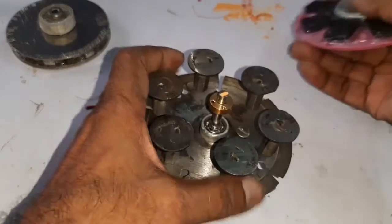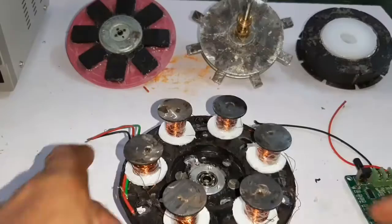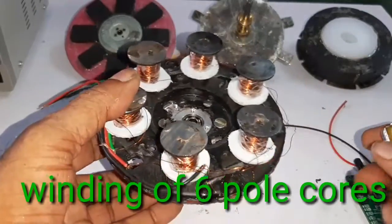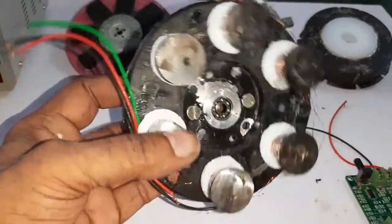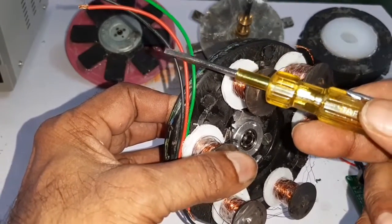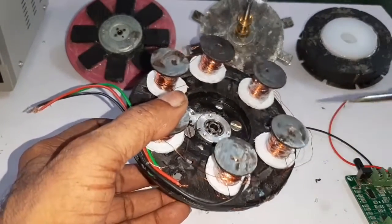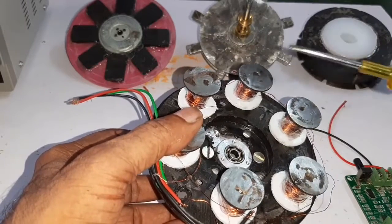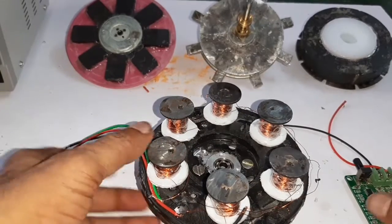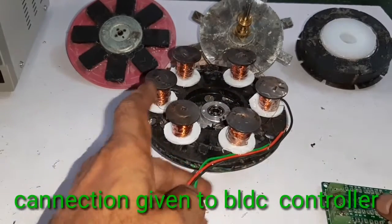Now I am going to wind the pole core. The six-pole stator is ready for operation. Here is the star point, and three source leads are taken from the finishing end of the coil. The six poles have opposite poles series-connected and the leads are taken out.